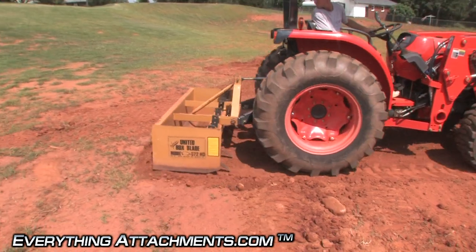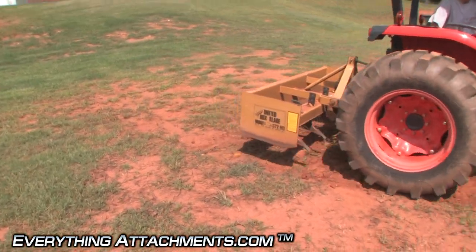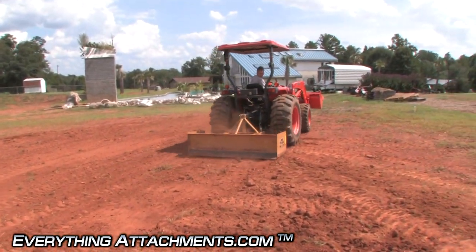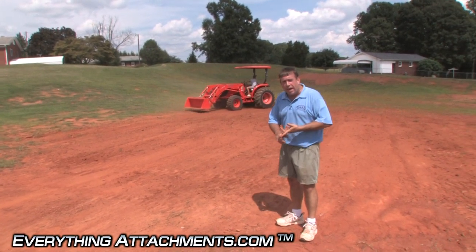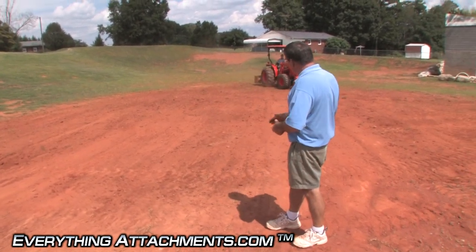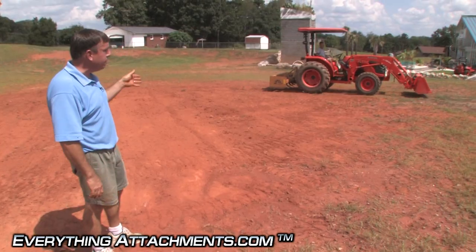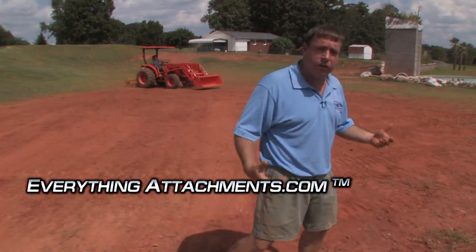How to use a box blade — even though it's a simple device — is probably one of the most asked questions I get on a daily basis. So you can see in less than 15 minutes we've leveled that big pile of dirt, cut a ditch if you needed a drain line, done some ripping if you were going to move a lot of hard dirt, and totally smoothed it back out. That is the most universal tool I know of — a box blade. We're fixing to hook to some pallet forks next, and the box blade is always your best tool to have on the back to give you a little counterweight.